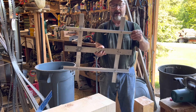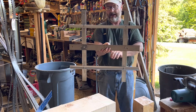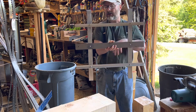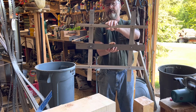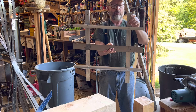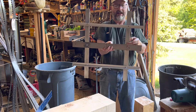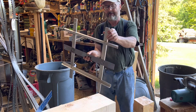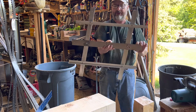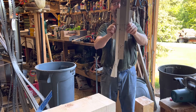From those marks, five inches in on this aluminum piece and this aluminum piece, five inches in, and then on the 19 on this end. So these holes between the square and these two are exactly the same. I took a measurement somewhere between here and here, and I think this measurement is six inches. I drilled these aluminum pieces at six inches exactly on both sides, centered on the square. When you put it together, it should come together perfectly like this.